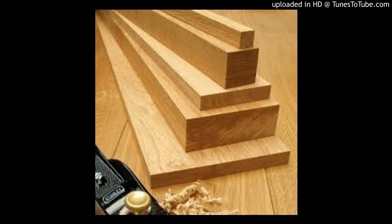Now, I did see a case where they absolutely wanted the screws to be in a straight line, and in that case we put a nail plate at the end of the joists, a stainless steel nail plate, which seems to have worked. But one way or the other, you have to consciously decide how you keep that last board from getting loose. And of course, there's less debris to remove from the side.